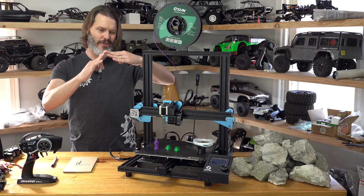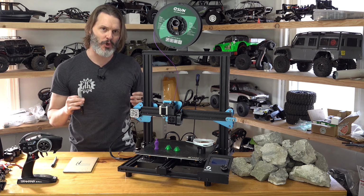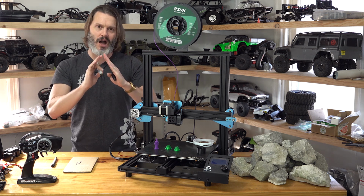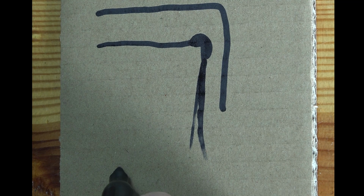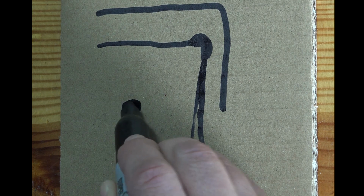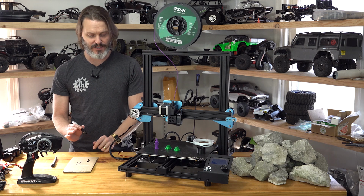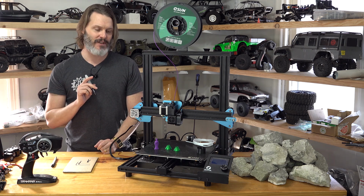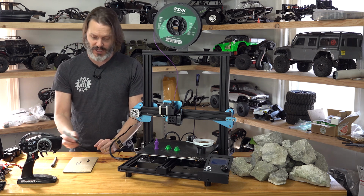If it's going to be a corner that's about 135 degrees or less, depending on the length of the Bowden tube, you're going to start having more and more problems with essentially a big blob coming onto your corner. If it's a hard corner, then it will literally go, and you will have these big, massive corners on a Bowden tube setup, because it literally can't accelerate well. The Bowden tube system cannot depressurize as fast as your machine can decelerate and re-accelerate into the other direction.